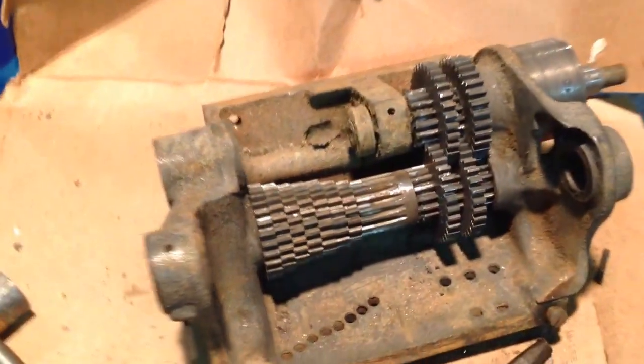Okay, this taper pin in here, there's the other side there, is stuck. I can't get it to budge loose right now, so I'm heating the torch up. I'm gonna get a little heat on it and give that a try. And while I'm at it, since I needed to start the torch up anyways, I'm gonna try and get that sucker to slide off of there. So we'll see how this goes.